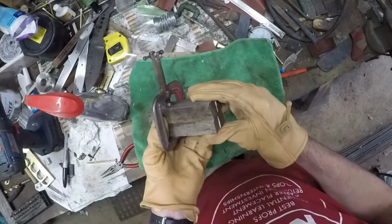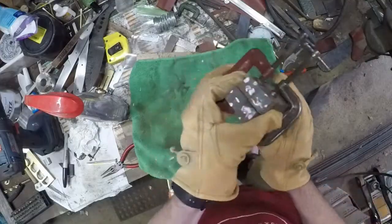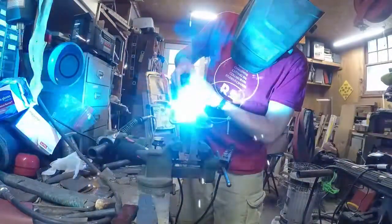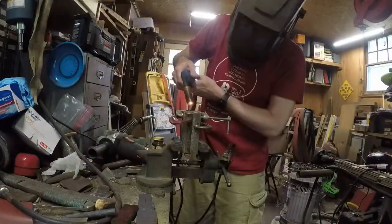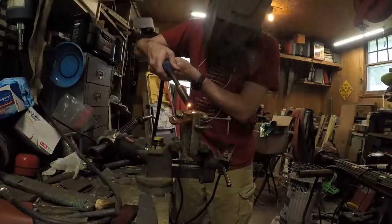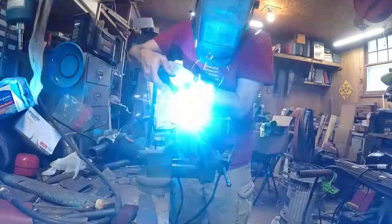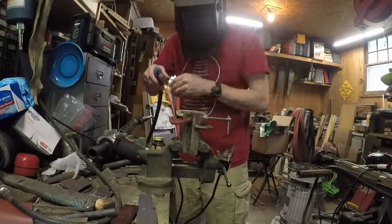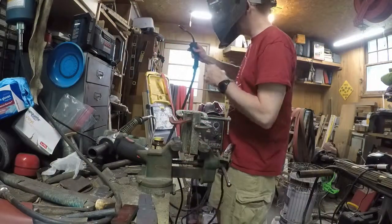Here I'm getting everything pretty well lined up. I'm going to move them into a vise and then tack weld pretty lightly. This weld intrudes into the steel and creates a problem in your pattern that essentially just has to get ground out. So anywhere you do any MIG welding, you're losing steel that you could use later on. The idea here is just to hold them together in the forge well enough to get the forge weld to stick.